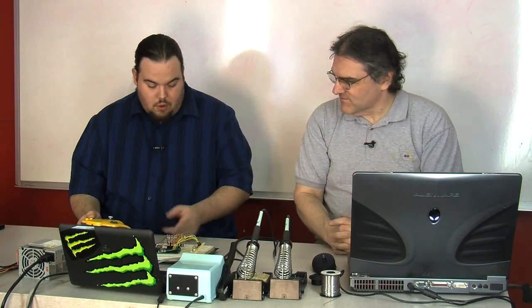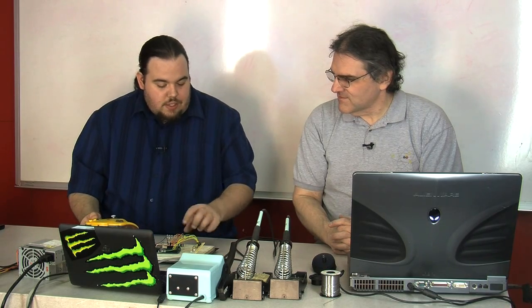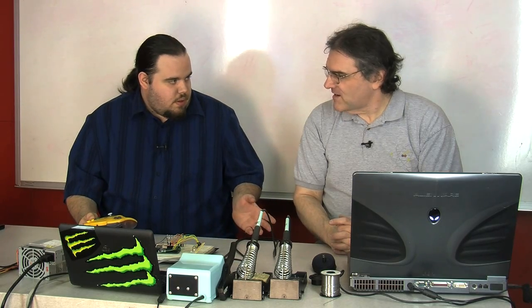So these are going to be outputs that are going to go to the motor — well, to the circuit that will go to the motor. The motor controller will take these outputs. What's really neat is we'll be able to just take these LEDs off the board and run a wire to it. I have some optocouplers. So we'll be able to plug those right in in place of these, and that'll simplify the process of designing that circuit quite a bit.